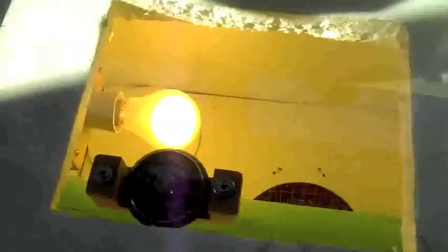Something worth mentioning: when you first set this up, you need to get a screwdriver. Wait till the temperature gets right up here — which is 99.5 degrees. Put the screwdriver in and turn it until the light clicks off. That way you know you're at the right temperature and it's automatically set up. The thermostat does have to drop a few degrees before it kicks in again, but it shouldn't upset your eggs.